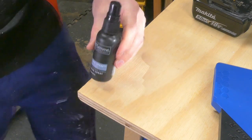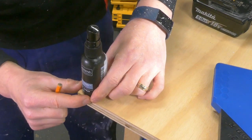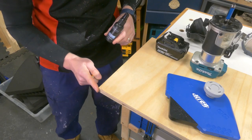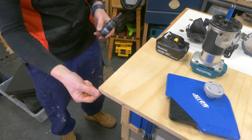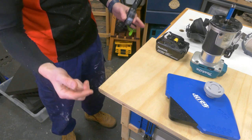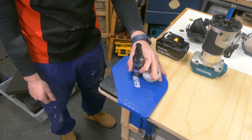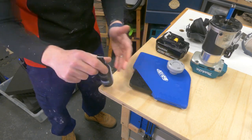The way I used to do this was to grab something round - don't ask me why I have hairspray in the garage - try to feel and line it up, mark it off with a pencil, and take it to a disc sander to take off the corner. That's perfectly fine and easy, it's just not as repeatable. If you're doing a nice table top, box lid, or something where you want it to look schmick, you can't beat the accuracy of a template. The only limitation is that you're restricted to certain fixed sizes, whereas freehand you can get anywhere in between.